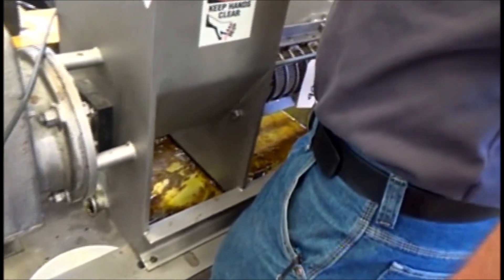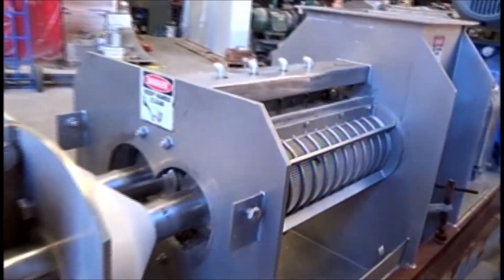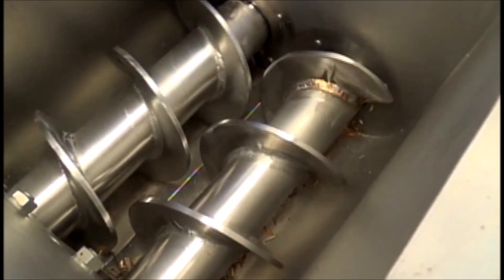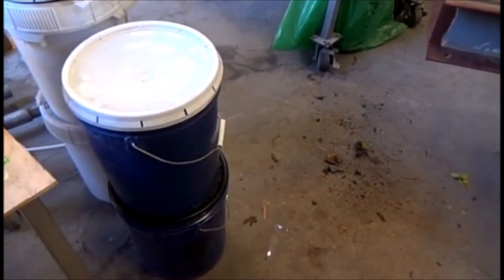Oil coming out, about the same as before. We're still at 18 RPM and 2 bar air pressure. But what we've set up here is a twin screw press, and the advantage of it is that the screws overlap — as you can see them overlapping there — and they overlap so that'll prevent bridging. That's what we're going to do with our next two trials, after we do double pressings.